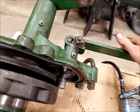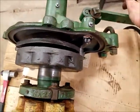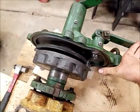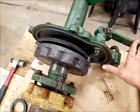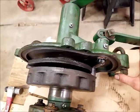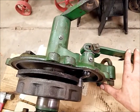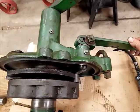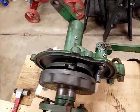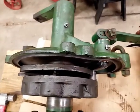Then this is spring loaded. So when you get to the end, like that, it'll engage in the bump on the other side, 180 degrees. The lift is in the other orientation now, and the wheel is back to free spinning mode. So if I turn and plow around or get to the other side of the field, whatever, I want to drop my plow back in the ground. I'm going along, I pull the rope, it releases that ear, it activates this, so your linkage moves, spins around 180 degrees, that spring loads back in, and when it gets to the end, it's free to freewheel here again.